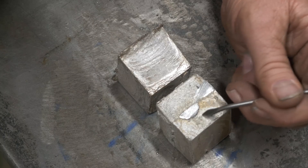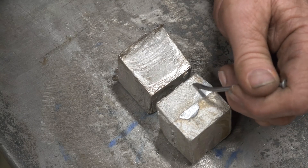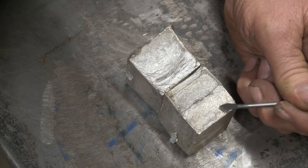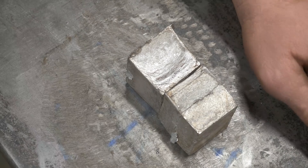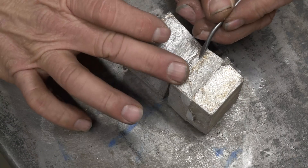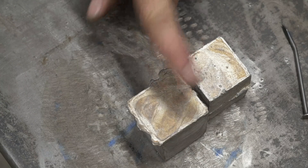All kinds of stuff happening right above the out gate here — it shrunk in, very defined line there, like there was something possibly happening right there. On the whole, I'm looking at a lot of little bitty things on this guy, and a couple of things on this one as well. So this is A and B again — A has another hole right there, a couple of small ones right here. But if I look at all in all, this is the tiny sprue and this is the big sprue.